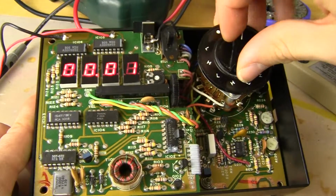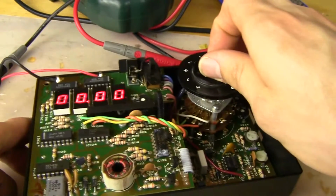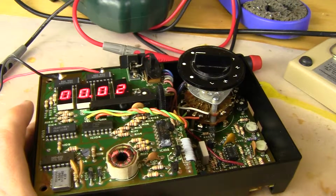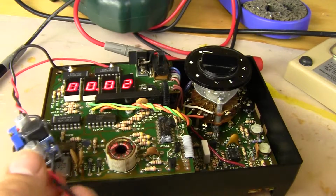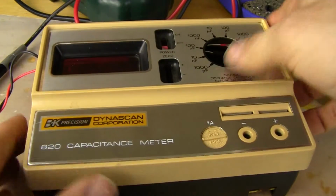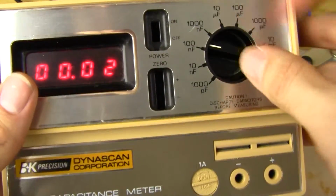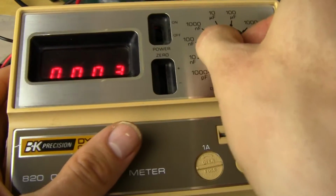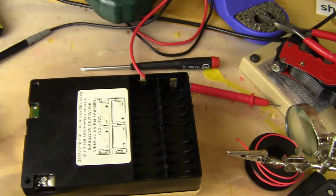Yeah, I can definitely hear a high-pitched whine from one of the oscillator circuits. I think I'll make the quick LM317 circuit, just because it's probably lower noise than this DC to DC converter right now. I'm not sure that I think it works right now. It's one of those things where you just get it and it works. The seller says it's not working, but I think it works right now. So we'll just solder right on there.